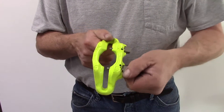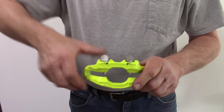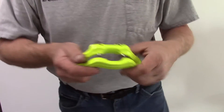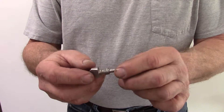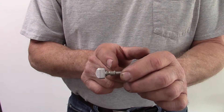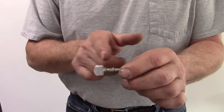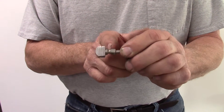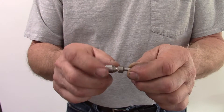It should snap back against a flat and you should not be able to turn the pin. On this particular one, I can turn one of the pins quite easily — the other one seems to work pretty well. Inside, retained by a roll pin, is a pin with a flat. The deeper flat retains it from coming out of the device. The smaller flat is supposed to keep it from turning, and there isn't much of a flat there.